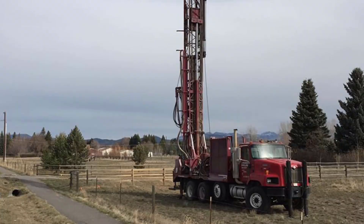The big thing that is DIY with geothermal — the ground source heat pump — is the loops that are going to be outside. Everything I'm going to talk about is specific to a horizontal closed loop system. Most vertical systems, whether open or closed loop, aren't very DIY and they sure aren't cheap. They require well drillers, and with a closed loop system they drop a long line down and grout the well closed — you can't do that legally. This series is designed for what you can do, and the closed loop horizontal system is the most DIY-friendly system out there.